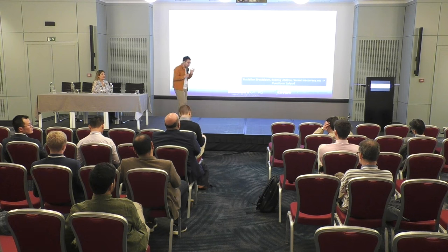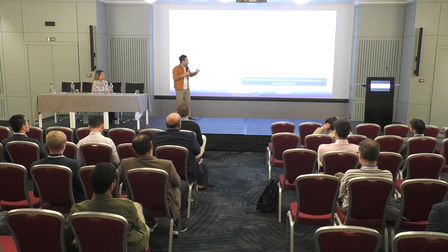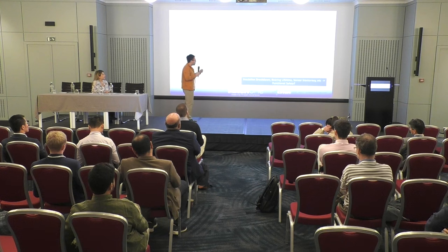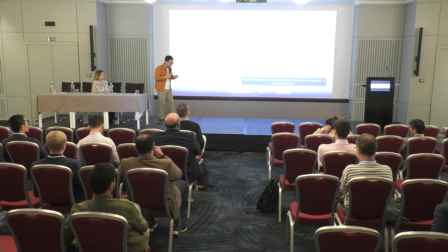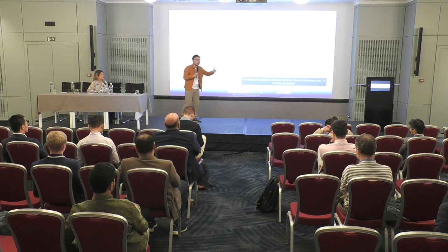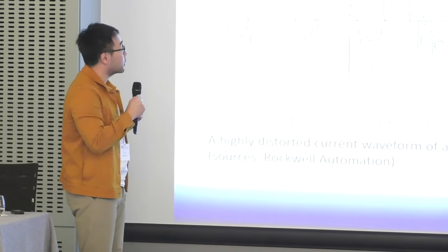That's a good question. This is why we need to do this workshop, because there's a big gap between academia and industry. As Barry said, normally in academia, for motor drive or motor research, you need perhaps 20 megahertz or 50 megahertz bandwidth as a good probe. These probes come from big companies like Tektronix, and cost lots of money, and you also have limited funding to buy this equipment. On the other side of the spectrum, in EMC, we start looking at issues at megahertz level, and we go beyond gigahertz. For that, you need special tools. But we'll talk about the tools you use later with Yegi.